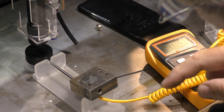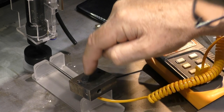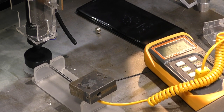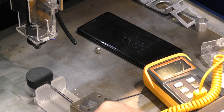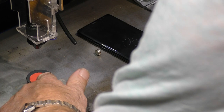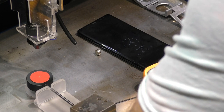Well, we're going to carry out some tests with this nozzle, but what I've done, I've lined the nozzle up in the centre of the doohickey, and I'm going to use the pattern that I've drawn to keep everything nice and consistent. So I'm going to drop this down well below the focal point. This is a 2-inch lens, so I probably need to be somewhere about there by the look of it. And I can set my disc on there, like that, and see whether we're still approximately in the middle with a pulse. Yeah, we're not far out, so that'll be okay.